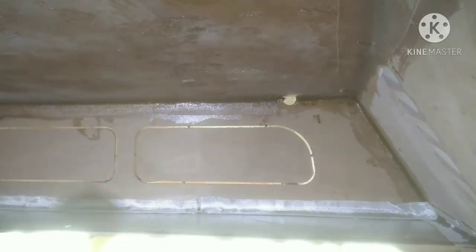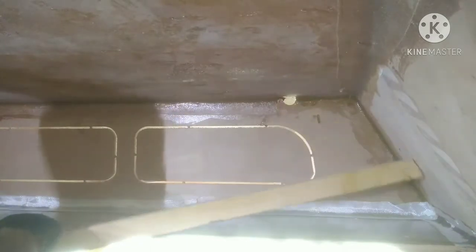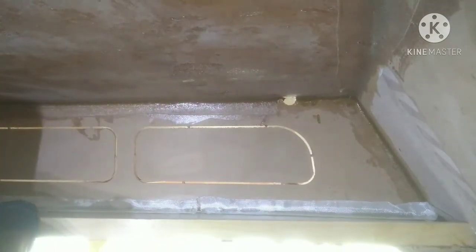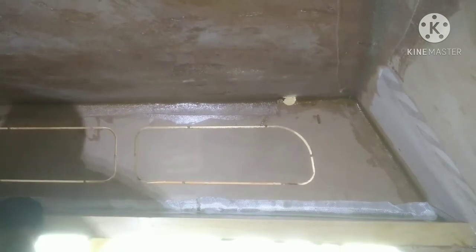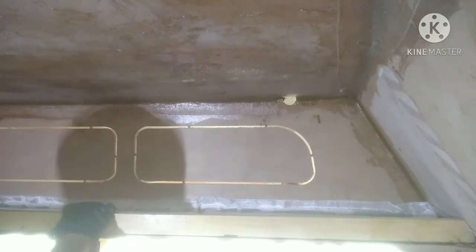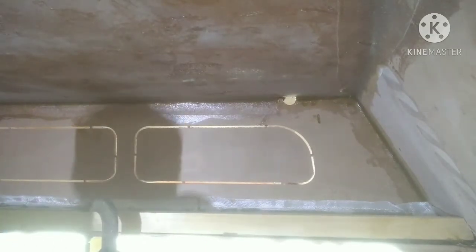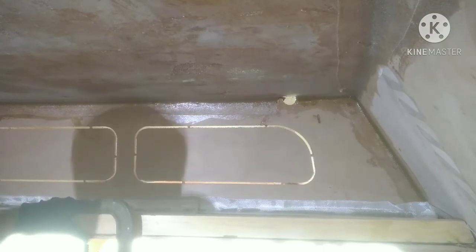And here's where I'm spreading a little bit of thickened epoxy on the seat stiffener that goes in front of bulkhead 2. You can see me placing it in here right now. And then I've got 5 C-clamps to clamp it in place and make sure that it is straight, because there's a little bit of curve to the seat, and if you get 5 clamps on there, it stays straight.